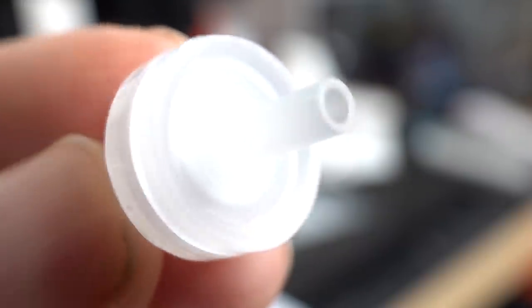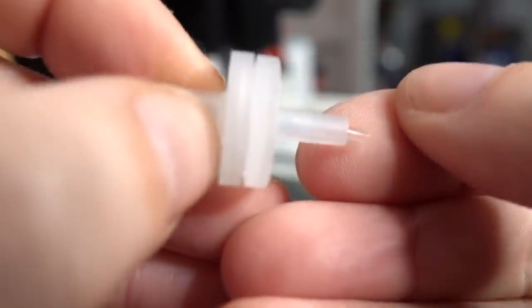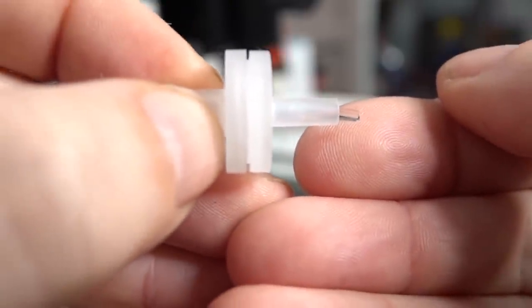So, those are the syringe filters that we used. These are actually polyethylene, which worked out the best for the chemically corrosive stuff we were using. It has to take low temperature — these things will take low temperature. It's going to take moderate pressure — these things are rated up to about 10 atm. So if you've got the filter here and the nozzle here, obviously there's not many places where the nozzle can pick up contamination. First thing you've got to do, you're going to clean that off as best as you can — get all the grease off your fingers and such like.